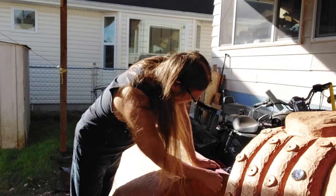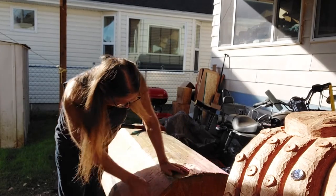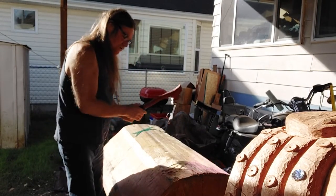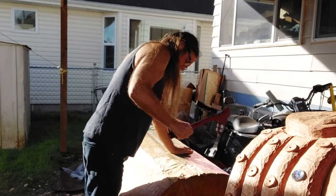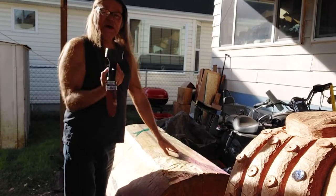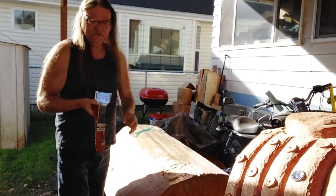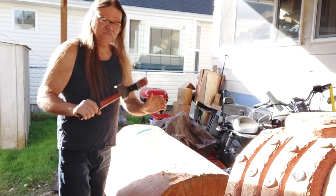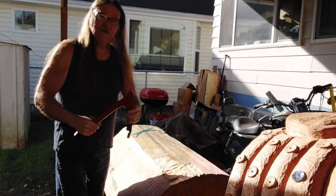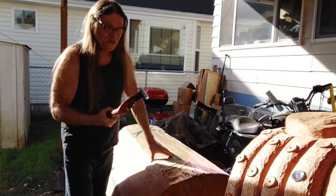I drew these lines that are going to come down at an angle, just like this. So I dropped this down, this stopped here. Now I'm coming down here and I've taken it up to this spot right there. With the lip adze that I used the other day — because this is a great tool — in the beginning stages, roughing stuff out, doing different things like that, the lip adze works good for that. Once I'm done doing all this with this tool, then I'll incorporate other adzes. But right now I'm doing this faceting using the lip adze.